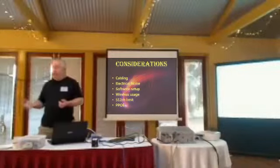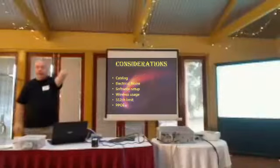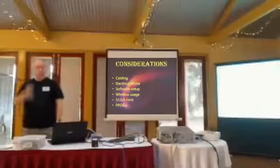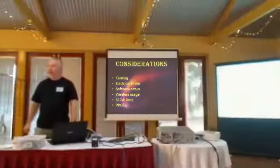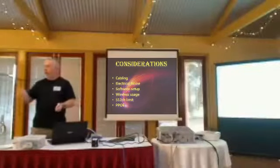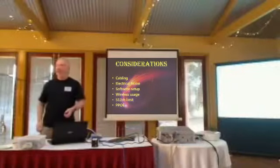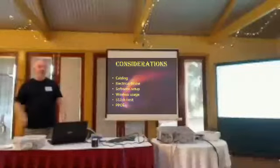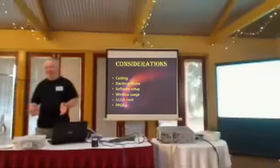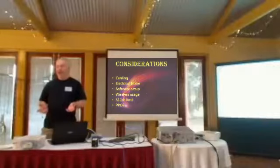My controller setup, and this comes back to stuff that you think won't work, went out, I terminated the end controller, just put the little jumper on, turned the rig on, and all the lights just didn't want to work. Okay. Pull the terminator off. Oh yeah, it works, flash. Terminator back on, walked up to the next controller and put another terminator on. Not what you're supposed to do. However, all of a sudden, my DMX network just worked. It wanted to terminate something. Don't ask me what it was. I have no idea. It shouldn't have worked, but it did. Okay? So, if you do end up with weird, strange things, don't be afraid to do something quite out of the box.